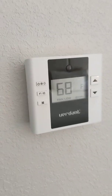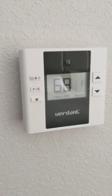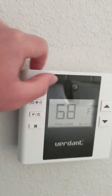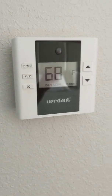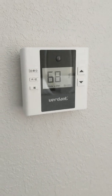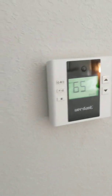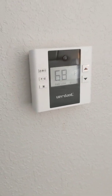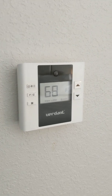But I like to override these so that I get a cool night in the hotel. So as you can see we've got the traditional, old school — I consider these old now — Verdant motion sensor. Now some guys will say go in here, undo the screw, go into the circuit board and push a little reset thing with a pin, and sometimes you do have to do that. But there is also an easier way depending on which PTAC unit you have over on the wall. I set it to 65 because that was the lowest it was going to go. But I'm a northern person so that's a little too warm for me at night. I like to get it a little bit lower, at least have the option to get it lower than 65.